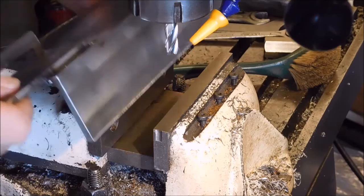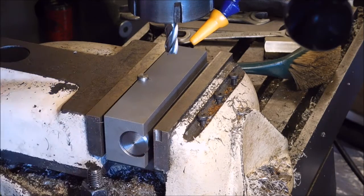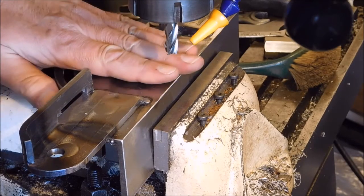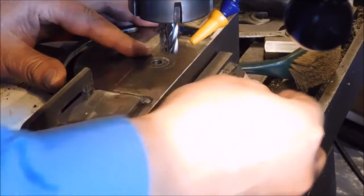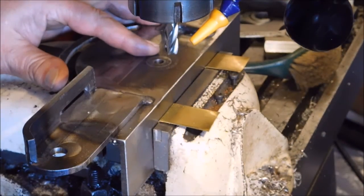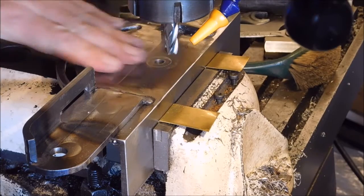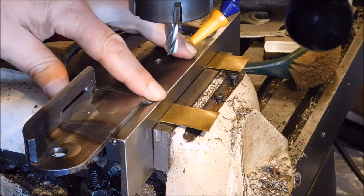Wonder what is wrong. But anyway, I have this tool here for gripping upon two axes, and I'll put that in here, and when I tighten the device, there's a small angle this way. Then I'll just put some brass shims in here, and then tighten it. It ain't that critical, but I can compare this surface with the vise here, and it is by eyeball parallel, and it isn't that critical.